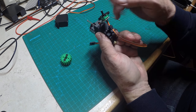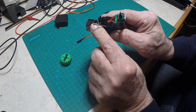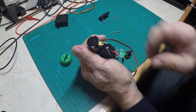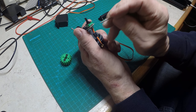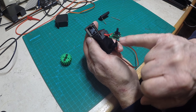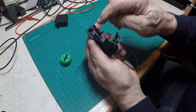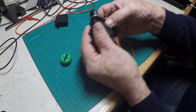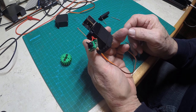There we go — we're together now. What we have to do is run the three wires from this pot over to here. The single wire on the end is the wiper. When you turn this pot counterclockwise, the resistance between two of the pins goes down. You want the same behavior from the original pot: hook the wiper to the center wire, then the wire that decreases counterclockwise to the corresponding pin, and the remaining wire to the last pin. If the servo turns on and keeps running without stopping, reverse those two wires and you should be in good shape.